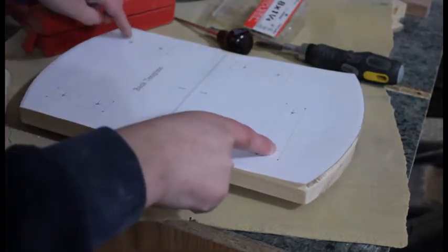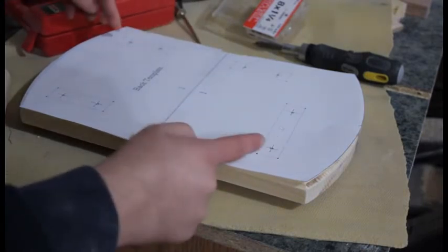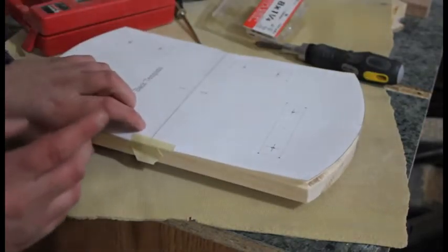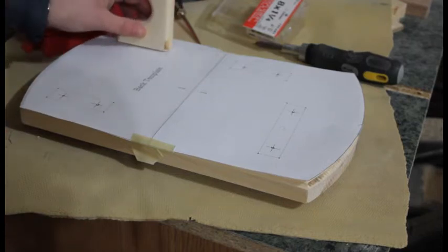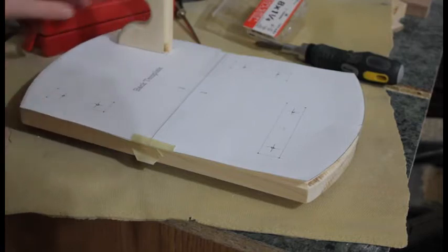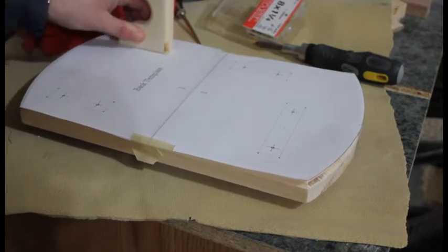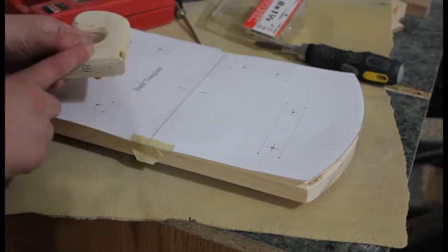I just used some screws in the corners, just so that I could line everything back up again. Then you want to put your screws in, just a little bit, pointing through each and every one of them. I used number 8 by 1.25 inches. Because then when you apply your piece on, you're within the zone area that's already centered. It makes it a lot easier. Then when you push it down a little firm, you have your 2 center points, which will be easier to pre-drill into these pieces.